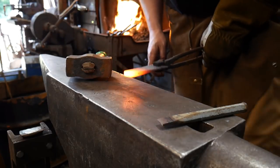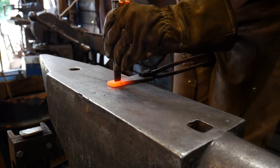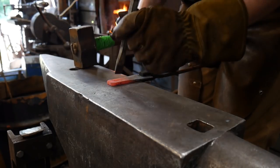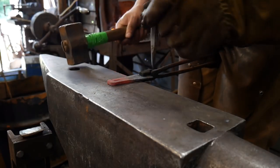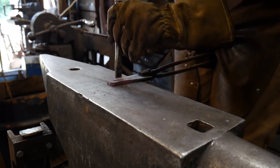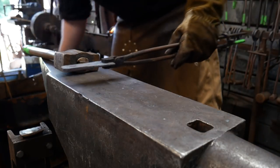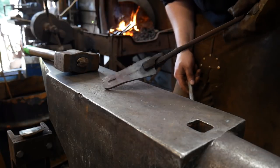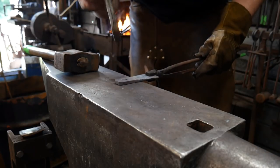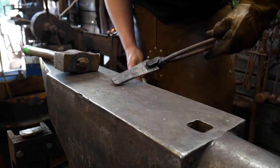I like to bring this out at a marking heat first using the punch — mark it out at a lower heat so I can get my punch mark started and know I'm starting it squarely through the piece. It's also not so hot that it causes the end of your punch to overheat. Then bring it out at a higher temperature, drive that to the anvil, flip it over, drive the slug out, and you'll have the slot punched hole.